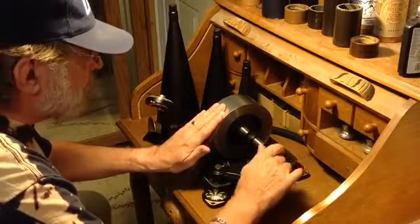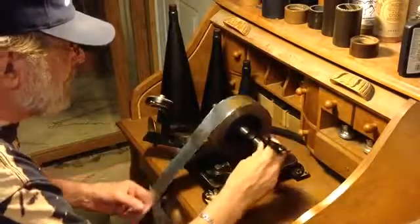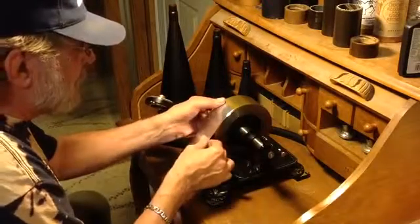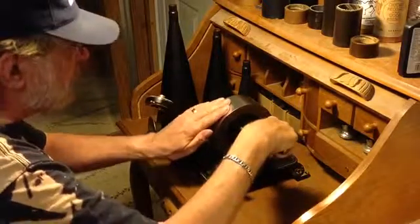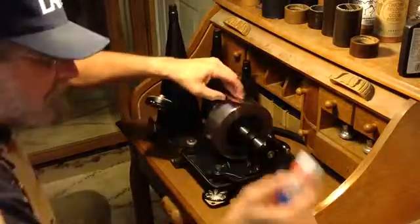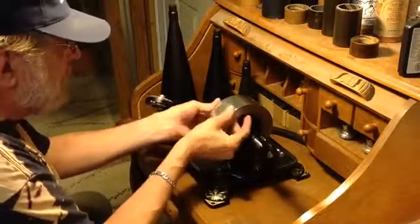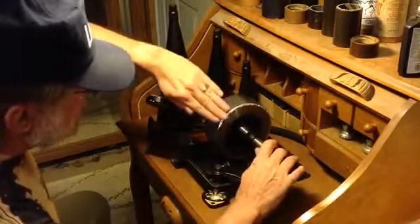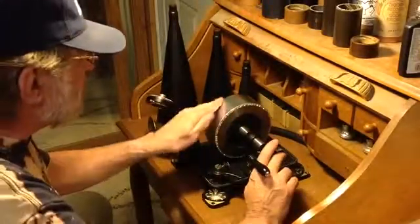But as I said, Mary Had a Little Lamb fits on this like that's what it was made for. And I'm really beginning to think that is exactly what it was made for, was recording Mary Had a Little Lamb. So right now I'm just trying to get the foil centered, or reasonably centered. There we go. This mandrel is 2 inches wide, so I'm cutting this foil about 2 1/8 inches, and whatever excess just rolls over on the side. Rolling this foil down really gives you a smooth, tight surface on the mandrel.